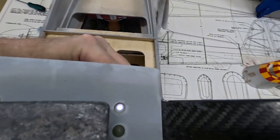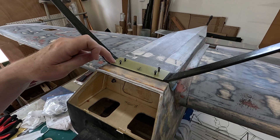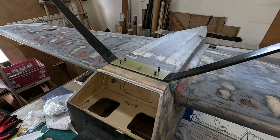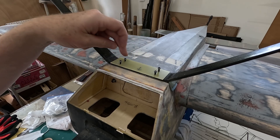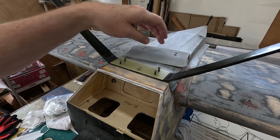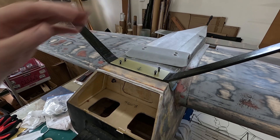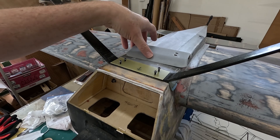The bolts are 3.5-millimeter diameter bolts, so I drilled 4-millimeter holes to give myself a little bit of play. After reinstalling the G10, two bolts fit well. The other two needed the holes elongated a little more forward, and then when I attached the cover, one of those ended up needing to be elongated a little more toward the rear. But now they all fit well. I'll end up using washers, so the elongated holes won't be a problem. The cover fits well also.